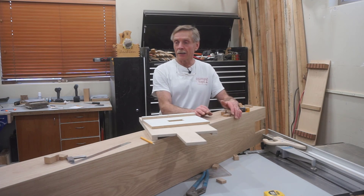I pre-marked the throat plate for the length of the center wedges. Back at the beam I take two of the side stub wedges with the pencil mark down and towards the center, drop them into the hole, then take a center wedge with the mark up, slip it in between, tap it into place, and drive it home. I can already lift the beam just by holding on to that center tenon wedge and it's not even glued into place. Once the beam is textured and I install these permanently, a little dab of glue here and there will hold them forever.